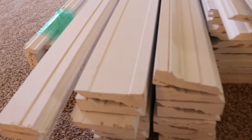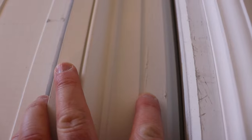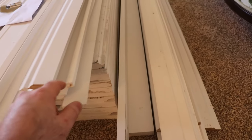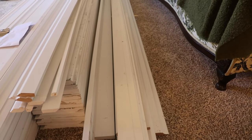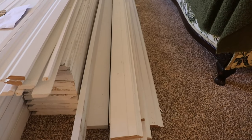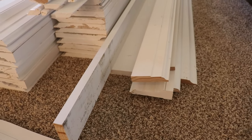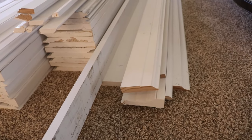When you look at it, the paint will have some cracks you'll have to deal with, so it's not like you're going to nail it on, spot-fill it, and spray it — there's going to be more work than that. With some of the really long lengths, if you lift it from one end and move it quickly it feels like it's going to break, but that hasn't happened. The way it's made, it's finger-jointed across this dimension, but some of them are glued down the long length and that profile is not finger-jointed on that dimension, which may or may not be a problem.